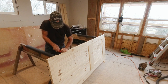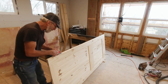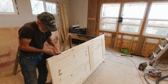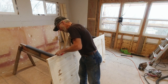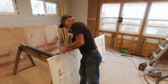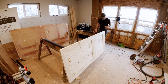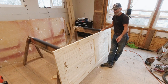When you're cutting across the grain it's going to be a little more difficult to get deep anyway. With that done I can remove the hinge, get out the hammer and chisel, and go to work with the actual mortising. Since these hinges are about an eighth of an inch thick, I'll also score with the utility knife on the face of the door so I don't chisel too deep. That has the mortising of the hinges done. I am ready to pick it up, sand the back side, and then this will be ready for staining.